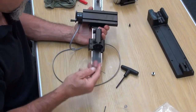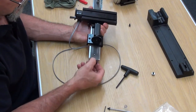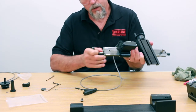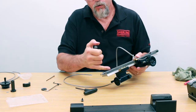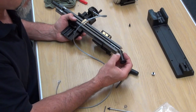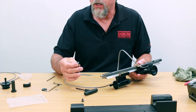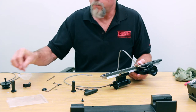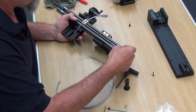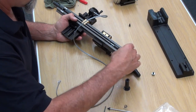We're going to take this screw the rest of the way out and replace the lead screw thrust. Here are the two parts. The lead screw thrust has a washer on the back of it. This washer goes against the shoulder on your lead screw. When you put this all back together, you are sandwiching this thrust collar between this washer, the shoulder on the lead screw, and the hand wheel. This washer has to be there — if it's stuck to your thrust collar, make sure it gets put back on, or you'll have problems with your assembly and your machine will wear out prematurely.